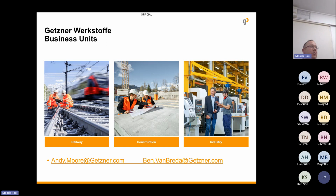Yeah. Because nearly universally, the way you're applying it, it's actually constructed with the sleeper construction. That's part of the concrete sleeper production. Yes, you're not retrofitting it at all. They can be glued. They're glued onto the likes of steel hollow bearers. And they can be glued if you've got the sleeper pre-existing for whatever reason. If you've forgot to add that when you're doing the ordering, then it is possible. The pad just comes out without the connection layer that normally goes into the concrete. Instead, it's smooth, so it gets glued on. So yeah, it's definitely possible.